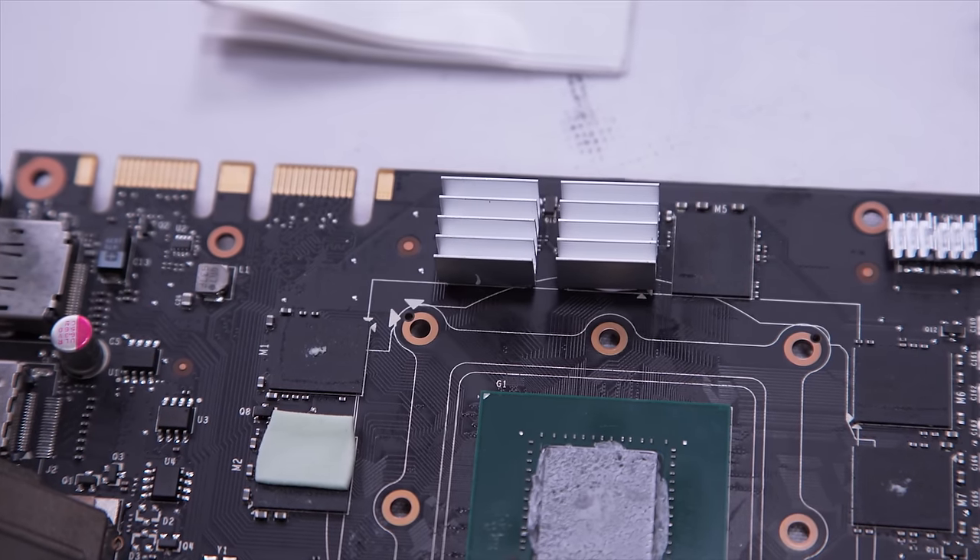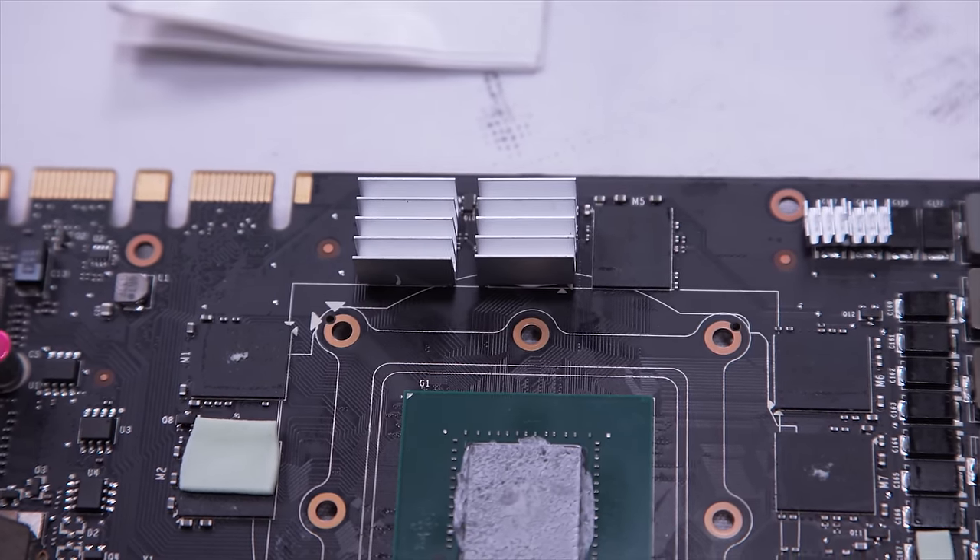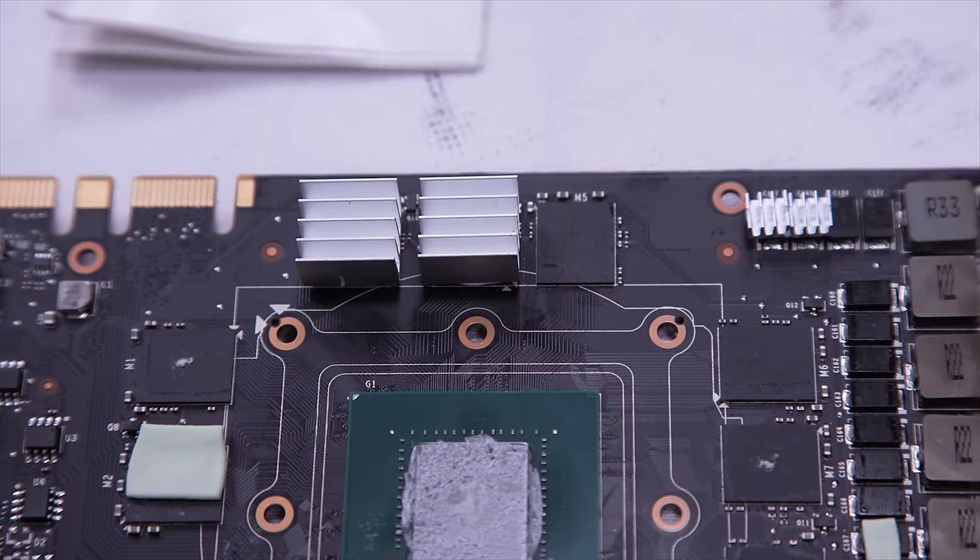It's Arctic Silver, so it has 62 to 65% silver content by weight. Pretty intense. But why would you want this? Well, if you're doing a mod to a graphics card which will remove the cooling on a few chips, or just working on a smaller electronics project, it can often be useful to add heatsinks in places where there aren't holes to mount them by traditional means. And since thermal stickers perform worse and don't hold very well under any kind of weight load, and drilling through the PCB randomly is obviously a terrible idea, this is better than nothing.